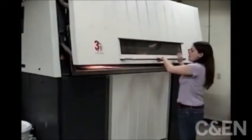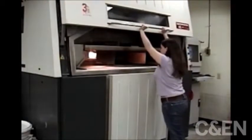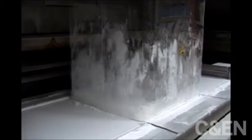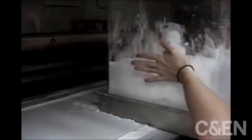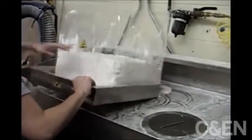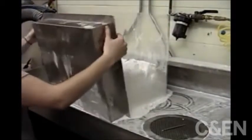The area that's being scanned of course varies from layer to layer. At the end of this, the parts are removed from the fabricator. We do this by pushing the part bin cylinder or piston upwards. In this volume, we have a lot of white powder that remains loose, but also the areas that were scanned by the laser produced the parts in exactly the same configuration that they were represented on the computer screen. The parts then are moved to a breakout table where we remove the powder, which is loose and recyclable.